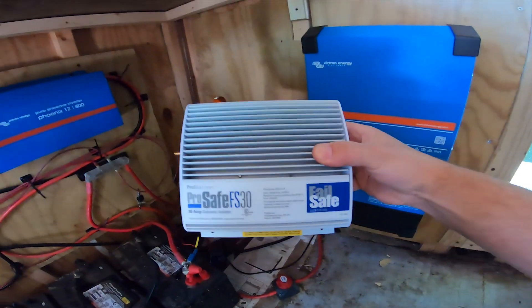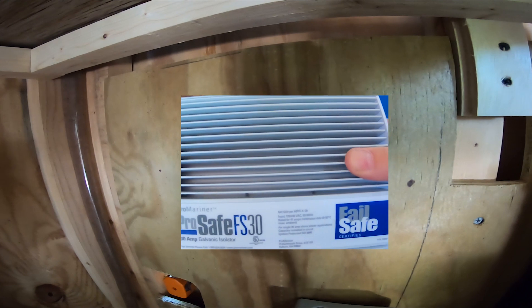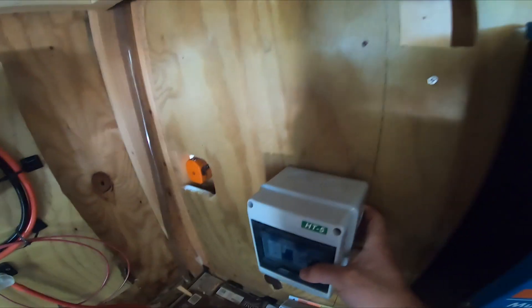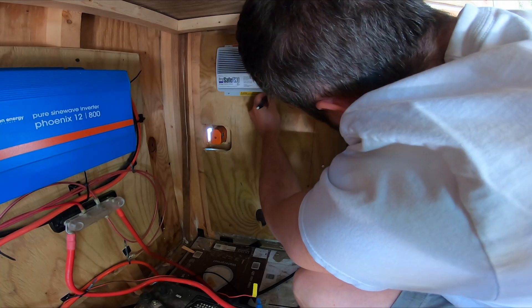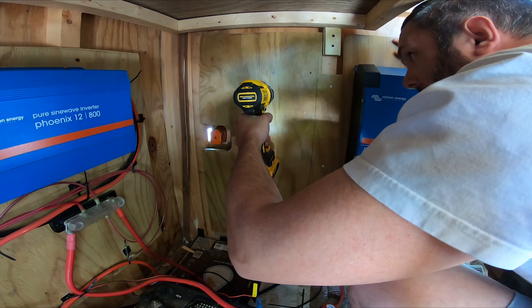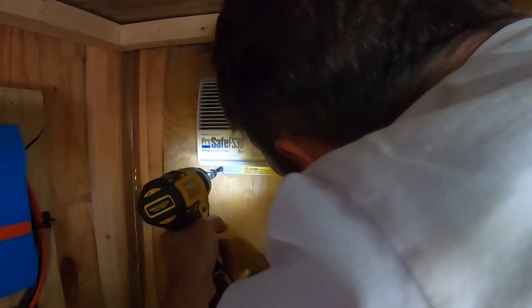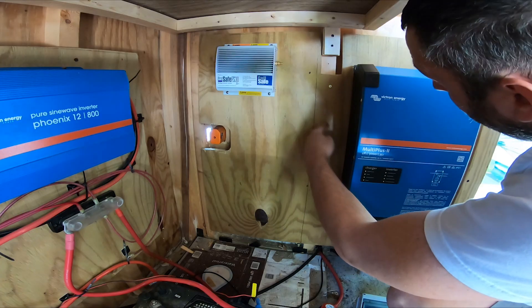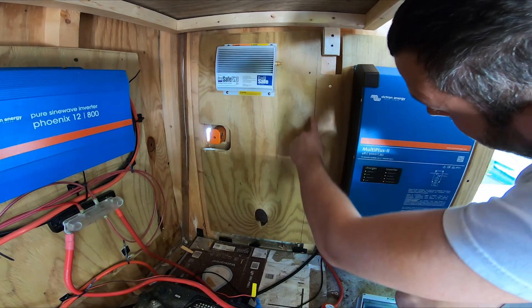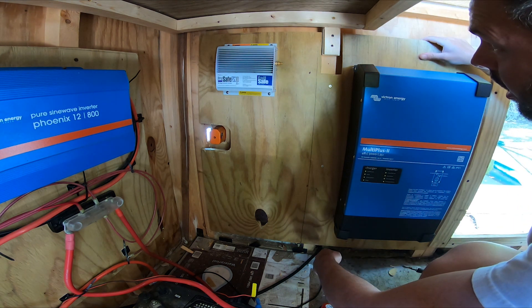Now we got to install a galvanic isolator because the wire is going to come in from there up to the galvanic isolator — galvanized stuff needs to get isolated. It's going to go into here so you can turn it on and off, then it's going to go down under to there. That's where all the AC electricity should be flowing in. I'm just going to go ahead and mark these holes. Everything is ready to be galvanically isolated. This random board I just picked out of my brother's garage has a line down it — we need to be four inches away from the multi plus, and this line is perfectly four inches away. It's destiny.